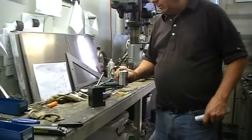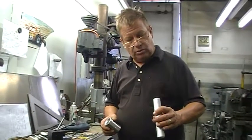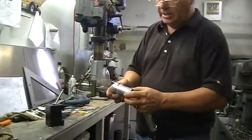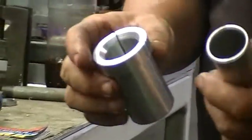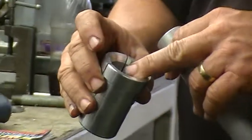So we decided that we would make our own flaring tool, and it lends itself to not only inch and a quarter, but any other size that you want to make. Now what we've made here is essentially a collet, and what it does is grip the tubing while it allows us to roll the flange on there.